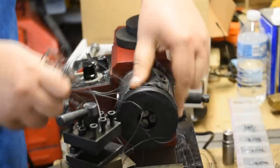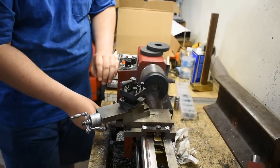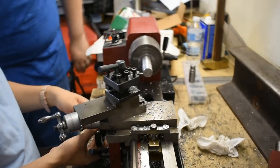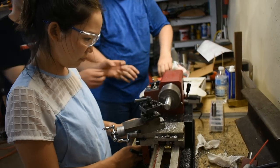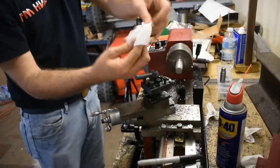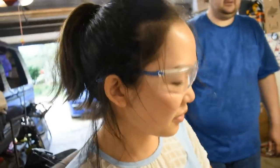Take your rings off — if they get caught on the chuck or anything, it'll pop your fingers. That's what a chip breaker is used for on the inserts. You can see how it got really splashy — that means you hit the end, so now take it back the other way. You can see you're getting really fine dust off, so it's just barely skimming. Toilet paper is great for wipe-down — it's very absorbent and picks up all the aluminum dust. They say don't breathe aluminum dust, so we don't want to breathe that. Fun stuff!